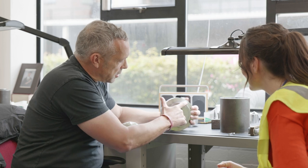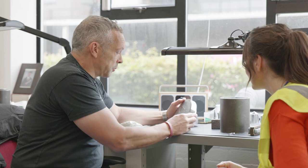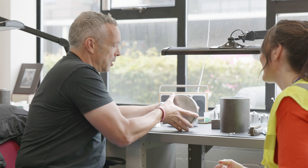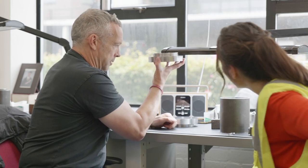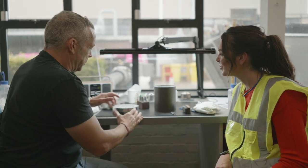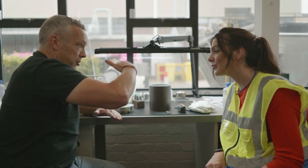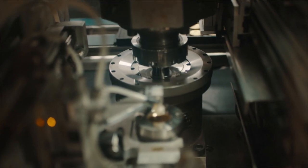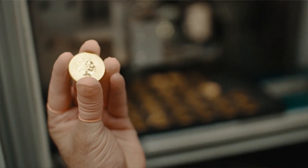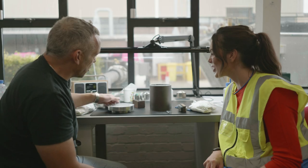And the reason why this is the shape it is, and with the threads at the back, it's because you've got to go into a press. So, for instance, we'll have that in a press that way, and then the other side will be facing up. So, as the press is struck, your blank is in the middle, and you will have the coin, which will be, like I said, heads and tails instantaneously.